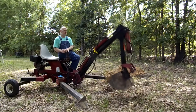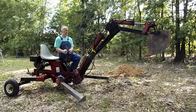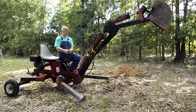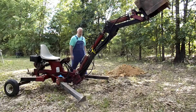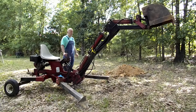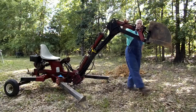One of the first problems I found is whenever you take the dipper and the bucket all the way up, they don't stay up as they should. It'll hold up as long as I keep pressure on this valve. As soon as I let go, it starts to dip back down. Not only this cylinder — this cylinder is doing the exact same thing.